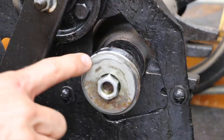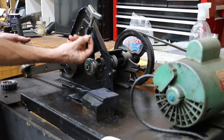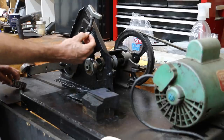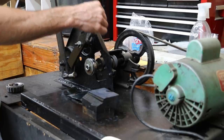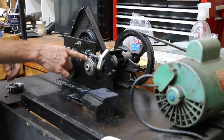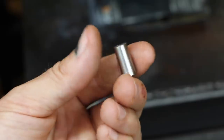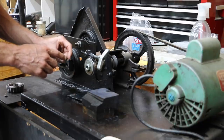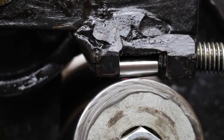The way this system works is this is a wheel race out of a bearing set. This wheel race will spin at 800 RPM during testing, which allows for a tremendous amount of friction on a bearing that is not moving. This bearing from a bearing set is applied directly onto the spinning wheel race, providing a tremendous amount of friction. The weight applied is right at 14 pounds of downward force, but given the very small surface area of the bearing, it actually translates into tens of thousands or even potentially over a hundred thousand pounds of force being applied to a very small area — and that's how you're able to determine film strength.